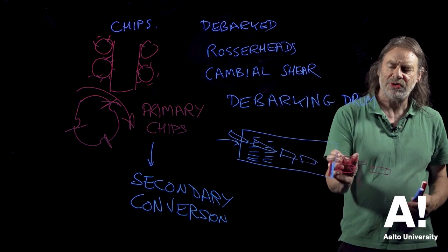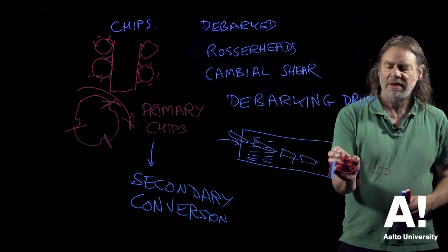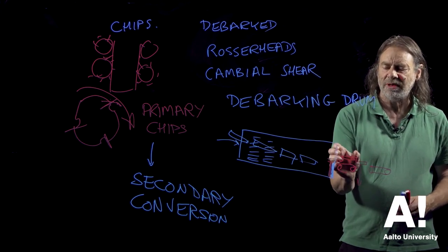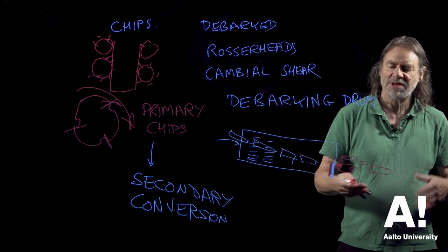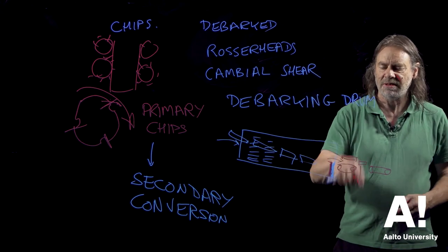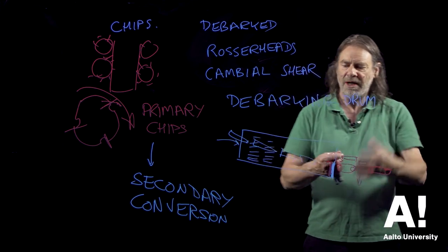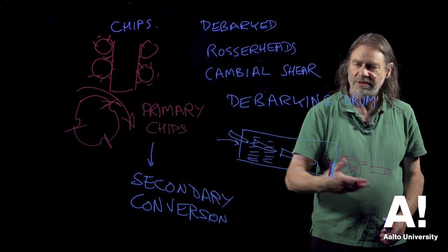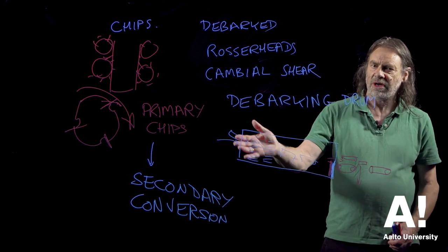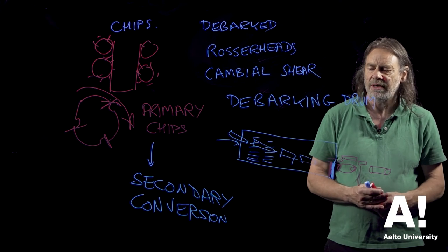If the sawmill can handle variable shaped logs, then it's not an issue. But not sawmill, a particle board mill. But if the particle board mill requires logs to be of a specific dimension, if it's set up that way, then they need to take these logs out. So basically the logs are rubbing against each other, the bark comes off, it drops through these slots, it's collected on a conveyor, it goes off and it will go into the recovery boiler, probably gets dried first and then goes to the recovery boiler.